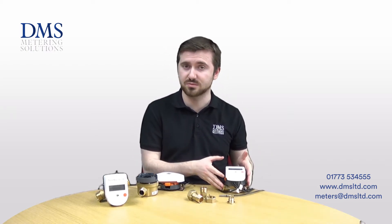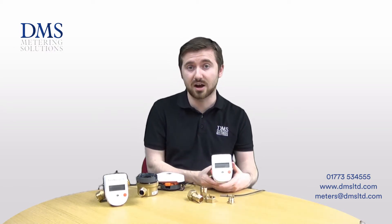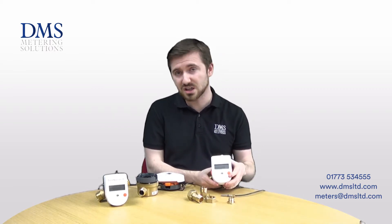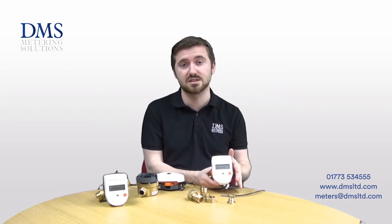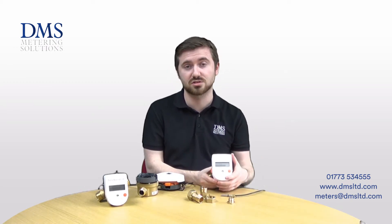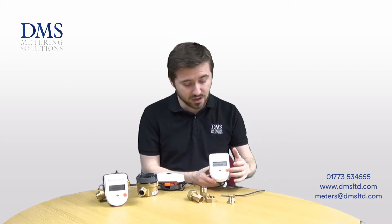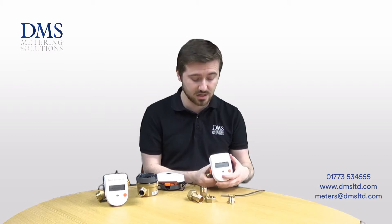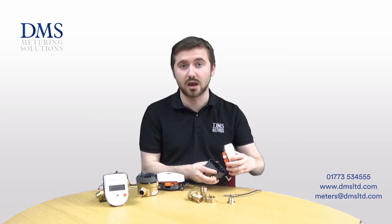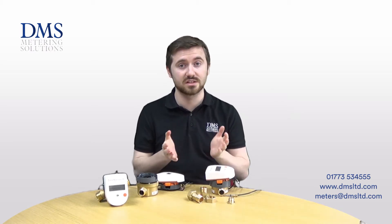This instead of the fluid oscillation principle actually utilises a mechanical turbine, so the accuracy of the meter is MID class 3. This means it's eligible to be used for domestic RHI installations, and that's probably where you would see the most use with it. With the smaller sizes, it's most suited to domestic installations, maybe HIUs depending on the requirements on site. Other than that, the design of the two meters is virtually identical — you've got the same displays, the same single button navigation through the screens, it can be mounted away from the actual flow meter itself, and the temperature sensor is again mounted in the body to allow for a lower cost of installation.